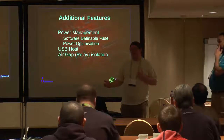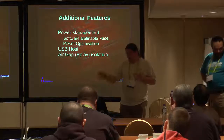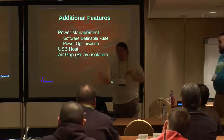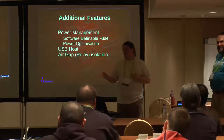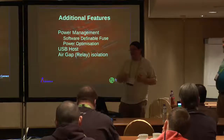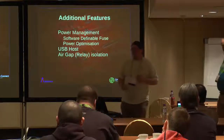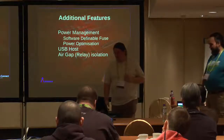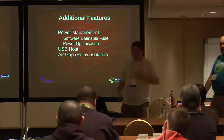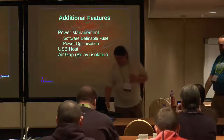You can just leave the unit for a period of time, let all the internal capacitors discharge. You may still have to leave the unit for a period of time because the unit I've designed doesn't have diode protection on the front of it, maybe some sort of FET protection, so you're not discharging power back up the power line, which means all my capacitors are not going to actively discharge from a short on the upside power rail. So you may still have to wait. You may still have to stick a 10K resistor across the input.